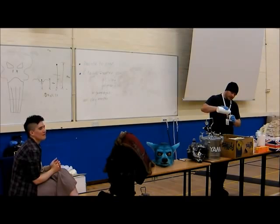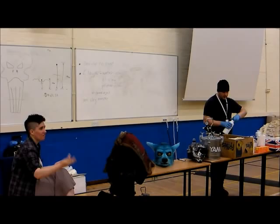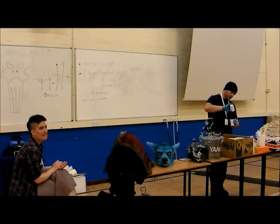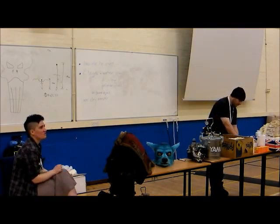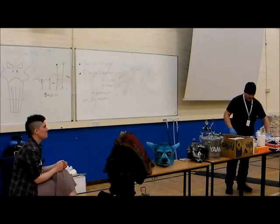Anyway, back to talking about safety. For the polyurethanes, generally, a reasonably well-ventilated room. The vapors are heavy, so don't do it upstairs, so they all fall down the stairs and kill your cats or whatever. Vapors are heavy. Wear a respirator anyway. It's probably overkill, but just do it. If you're doing anything casting-wise, you should probably pick up a good respirator. Always use scrap objects to stir with, because when you stick them down on kitchen towels, they stick to them.